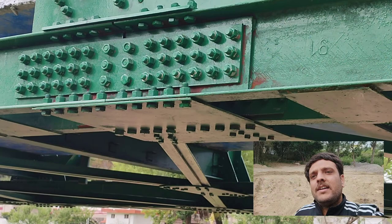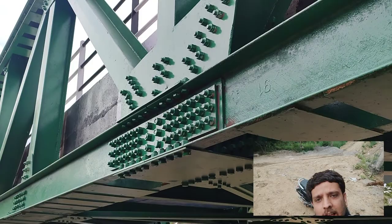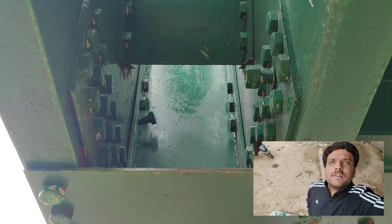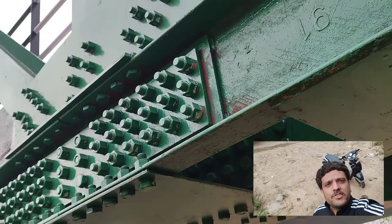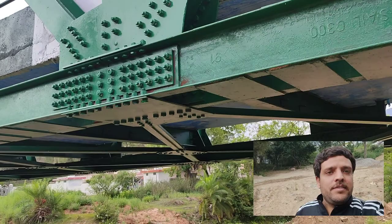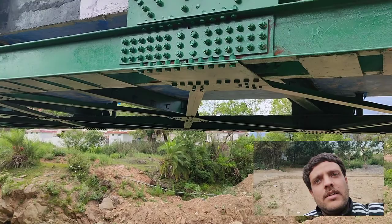It is 18 plus 18 plus 18 on both sides — 36 and then 42 on the flange itself. This joint is a double cover butt joint, as you can see a cover plate has been provided in the splice zone on the outer face. On the inner face as well, the gusset plate is acting as a cover plate, and one additional cover plate is also provided. So the number of cover plates is two, and slip resistance will be more because the number of interfaces available for shear failure of the bolt are more in a double cover butt joint.